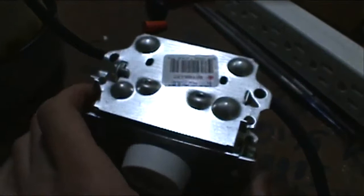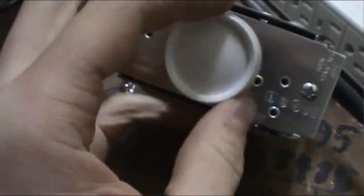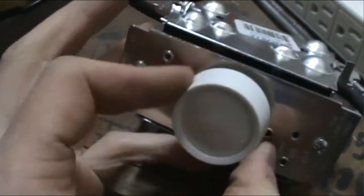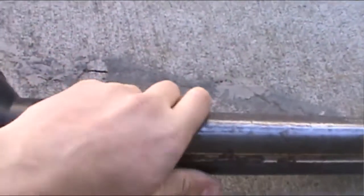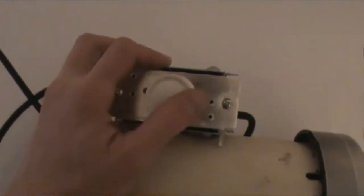Alright, so today I went out and got this. This is the piece for the dimmer switch that I got for my forge blower to control the flow. Turn it all the way to the left, it's off, and then turn it on and all the way up to high. I got this coupler piece here that takes it from the large size down to the smaller size. This is the size of tubing that carries all the air through my forge. So I got this dimmer switch on it, so I can change the speed, thus the airflow. Plus sound is a contributing factor to why that is there. It just goes into here where it's connected, and then the other part goes out where it has the wall plug.